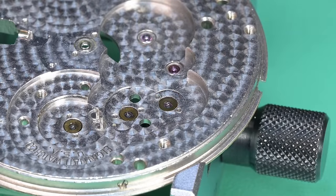After dialing in the watch over a few days, it's time to install the dial and finish up. I'm applying some lubrication to the outside of the cannon pinion so we can put on our hour wheel, making sure it's flush with the pinion on the minute wheel — that looks fantastic. There's our dial washer. Now we can install the dial, making sure those dial feet are aligned and in their home — seated down properly. We'll tighten the three dial feet screws. I've read that if you crank down too much pressure on the dial feet it can make small cracks in enamel dials, so I'm just snugging them up.